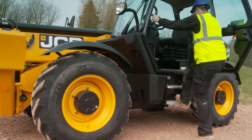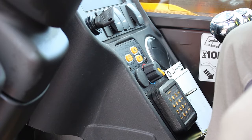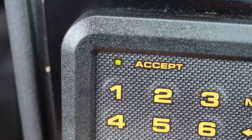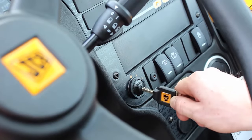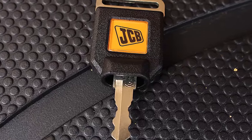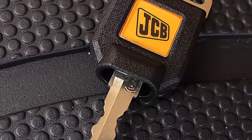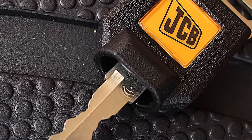After 15 minutes, key off the ignition, then key on and enter the correct code. The green LED will come on and the machine can be started. The unique key immobiliser system uses a special ignition key supplied with the machine. You can only use this ignition key to start or operate the machine. This key can be identified by its larger body and a radio signal symbol on the key shaft.